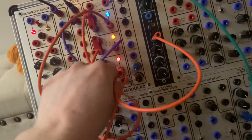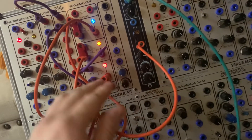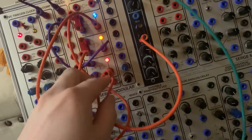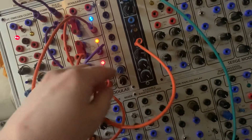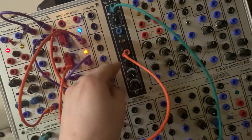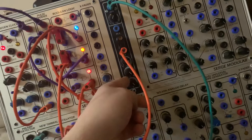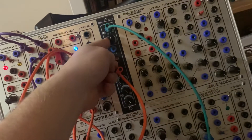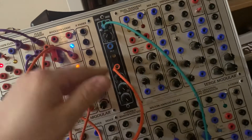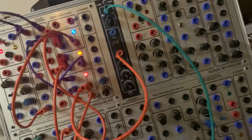The output of this exclusive OR gate — because we need to be able to push the pitch both up and down — a zero to five volt signal won't work, because all that can do is push it up. So this signal comes over into this mixer. It's bridged again, so this is zero to five, and then we add it again so it's zero to ten, and then we bring it down negative five. Now that zero to five volt is negative five to plus five, which gives us a nice full swing.